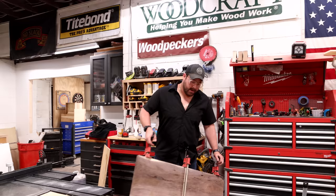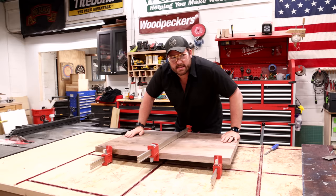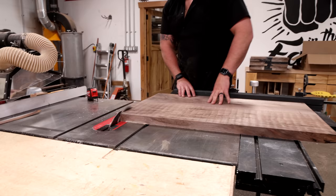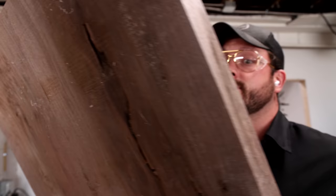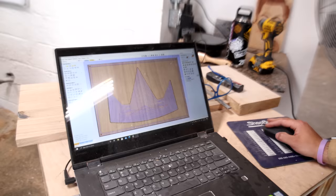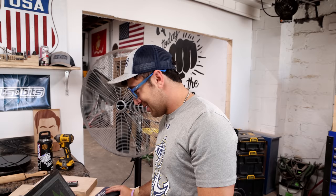We got these out of the clamps, cut to size, and now it's time to cut King Mead's logo into the center portion of the bar. We're going to do a 5.5-inch pocket cut — you can see here — with an inch border around it, using a Bits and Bits half-inch downcut spiral bit with astro coating. We're going without the dust shoe so you guys can see the cutting. This bit is very scary — fire up!